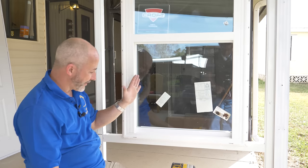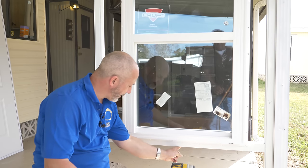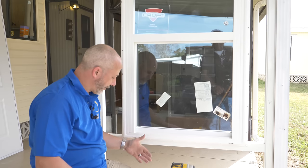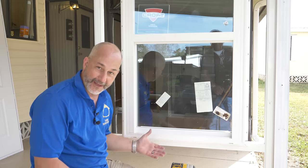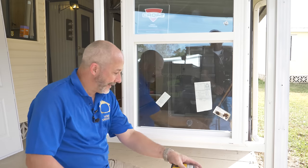So we're gonna call this side done. What I am gonna do is I'm gonna add one more stick right here underneath the middle to the ground, and it's not to carry the weight of the window. It's so that the siding has actually got some stability because you don't wanna go fill in a 42-inch gap with nothing in behind it, all right? I might even go with two. I'm not even sure at this point, but I think one is gonna be plenty.